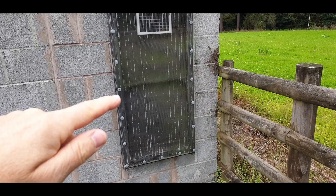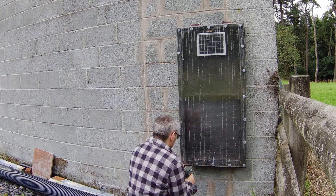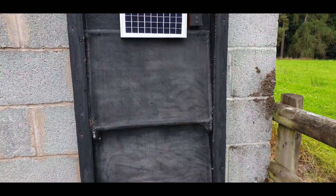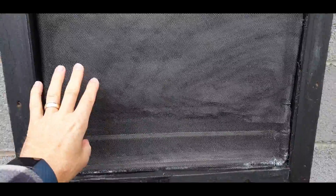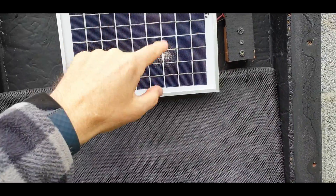I've got a couple of repairs and tweaks I want to do to our two existing solar furnaces that we use to heat this shed. First thing I'm going to do is get this off the wall and take this polycarbonate twin-wall cover off so it doesn't get damaged, then get the frame off and go through it all. The basic guts of it: there are vents in the bottom bit that let cold air in, a heat sink with some copper pipe painted black, and the cool air comes up through it absorbing heat. A solar panel powers a little computer fan directly behind there.